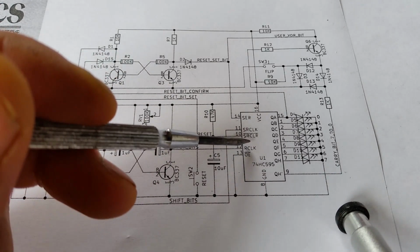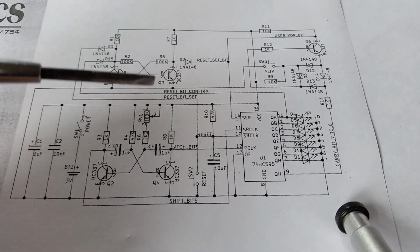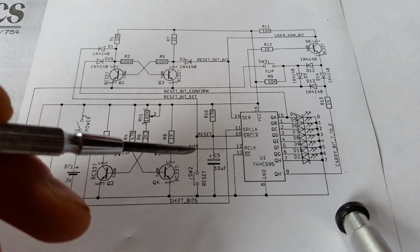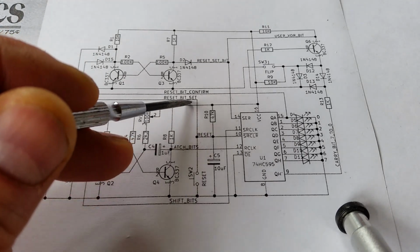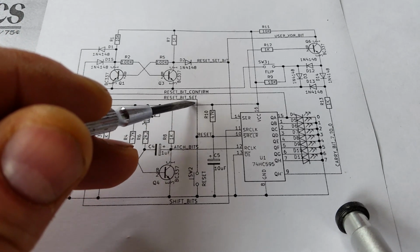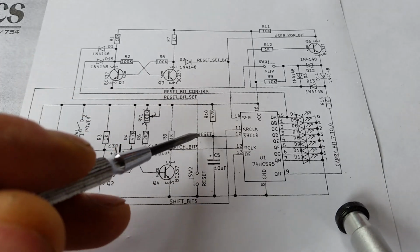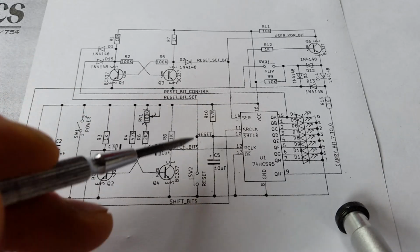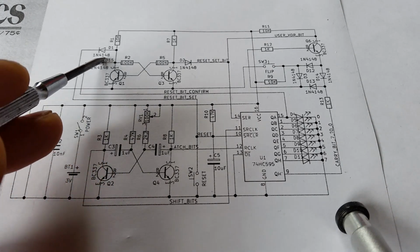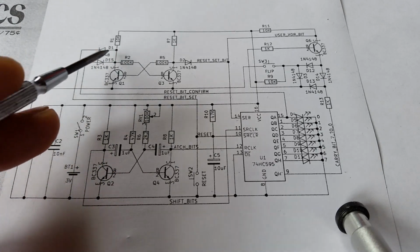But clearing the shift register will just clear all of the LEDs, and you won't have any of them lit. So you need to actually light one of the LEDs in order to start the game. So I have the signal coming up here, and it's saying the reset button's been set, so we need to set one of the bits of the LEDs. So that'll happen whenever it's powered on, or if you hit the reset button, this will then go low.